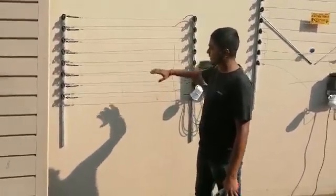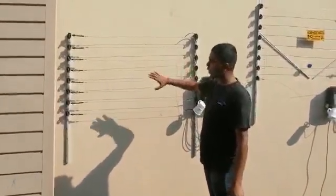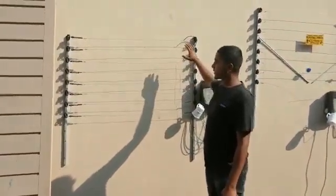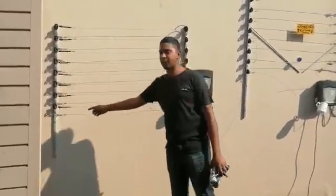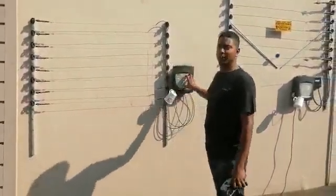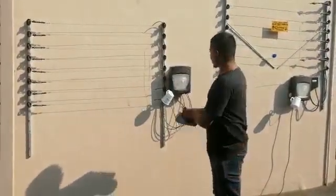In practice, if this fence was 800 meters long with an 8-line fence you'd possibly have six live wires, so your total live wire distance should be 800 times six. But in actual fact your live wire distance is only one length of wire — 800 meters — and that's why a small energizer would appear to be doing the job, but it's actually not secure.